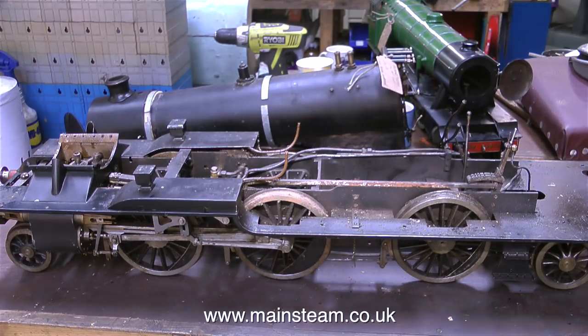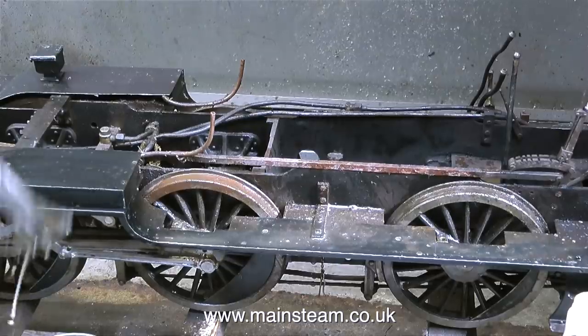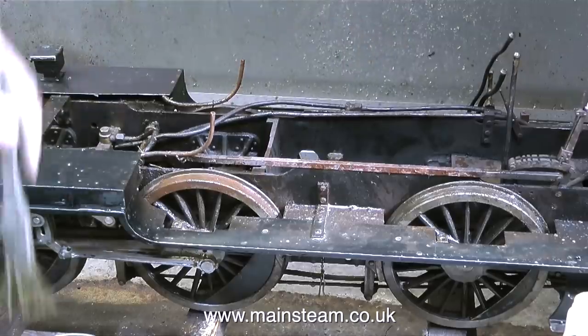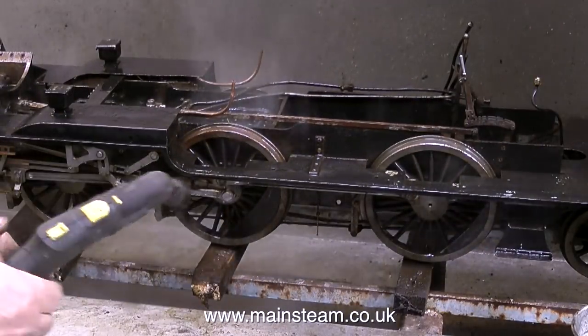Before I refit this boiler to the chassis I'm going to clean it up, because it is a little bit on the rusty side and I don't know what the mechanical condition of it is like. So I carried the chassis across to the washing area, and in this clip I'm applying some TFR traffic film remover and a mixture of that and panel wipe, which is like lighter fuel — lighter fluid. This degreases very well, but it's not enough on its own — it needs the steam cleaner to just help it along.